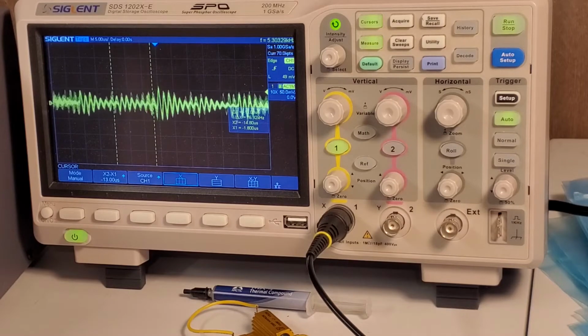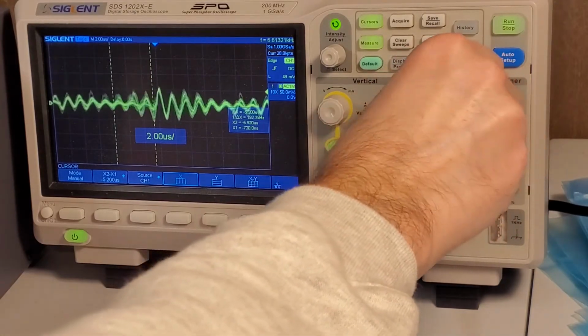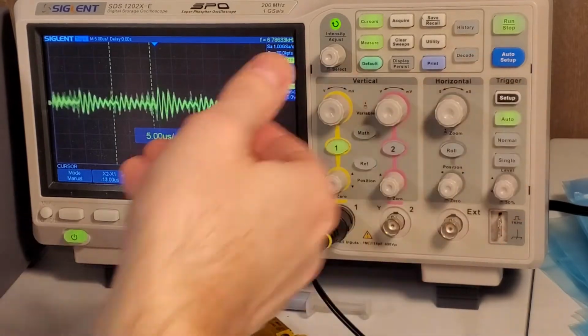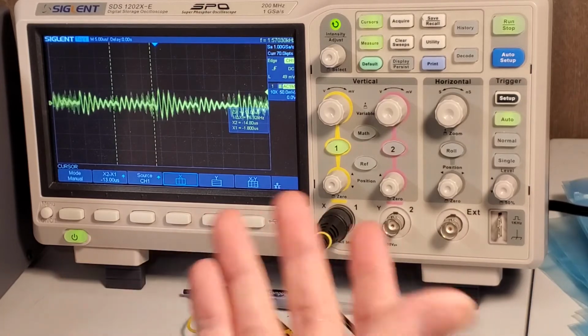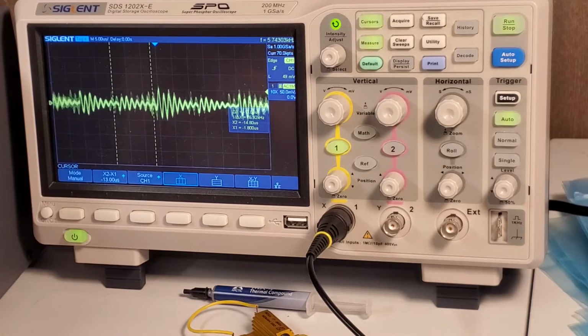So depending on what you're doing, if this is plugged into an audio system, you'll never hear it. It's above audible frequencies. But it's not beautiful. Again though, $50, pretty decent. If you really wanted to knock that out because you're trying to do a low-level measurement, you could always on a breadboard put a linear regulator past this, especially an adjustable one, and it would help cut that probably by at least 20 dB, 30 dB most likely.